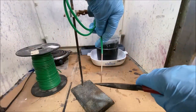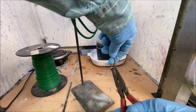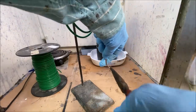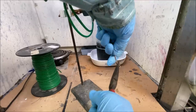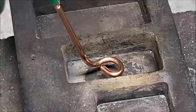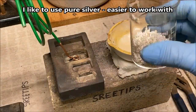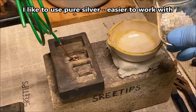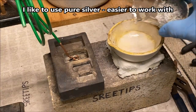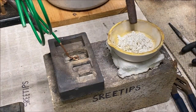I've got the piece of wire and a clamp. I'm going to grab a piece of it down here and form a little loop. Here I've got the little curl of copper wire suspended in one of the cavities of a graphite mold. Now I'm going to add the silver we measured out — about 3.3 troy ounces, which is more than we'll need but I need extra to cover that piece of copper wire. I'll add it to the melt dish and melt the silver.